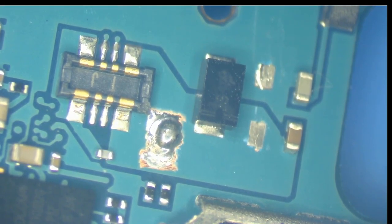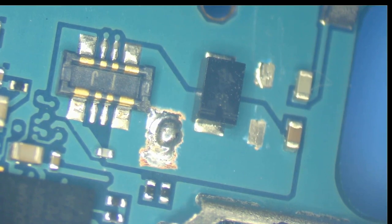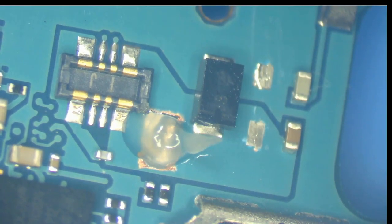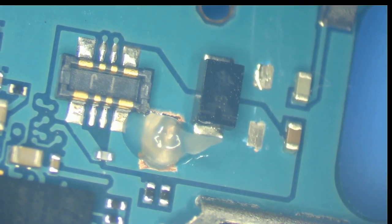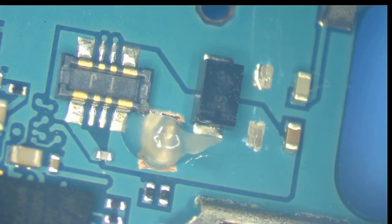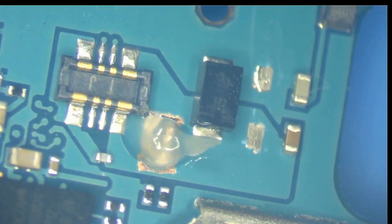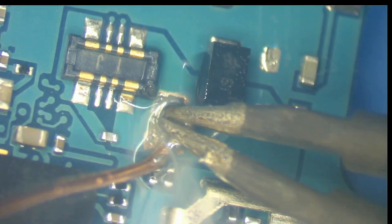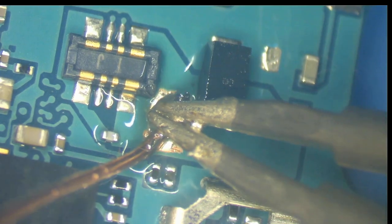Is this the kind where you can just take the chip off and read it? It is not that kind, so you've got to make it work — pressure is on. There is a Dediprog reader for S6 chips, but it's around $3,000, requires the chip to have balls, and the chips are very sensitive to heat. So you have to re-ball with a very low melt solder. It's easier to just make the phone work again.